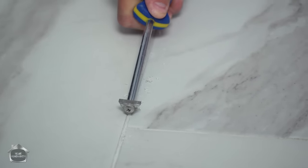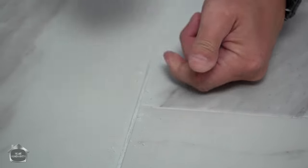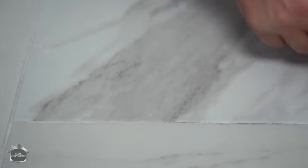When you get near a corner, stop pushing. Start near the corner and push away from the corner, or pull from the corner. The idea is, if you're going to clean this way, you don't want to push through and chip your tile.